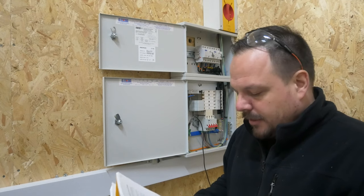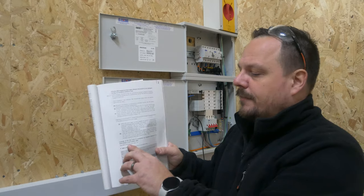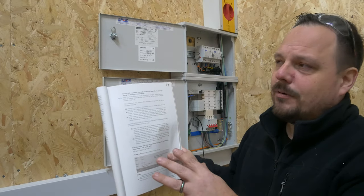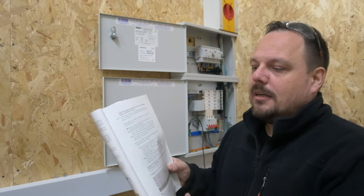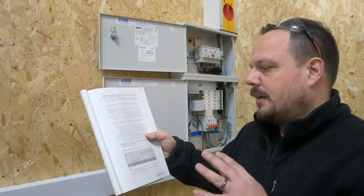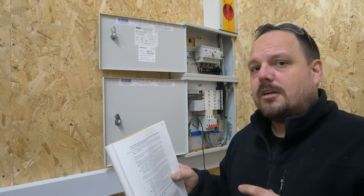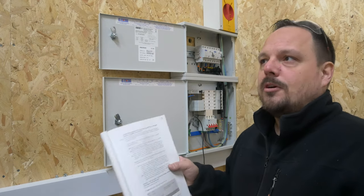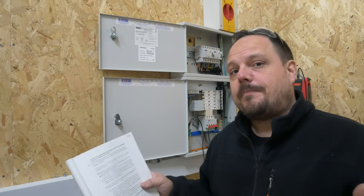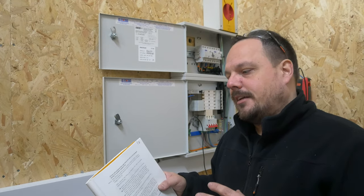When it's talking about your insulation resistance test on a three-phase circuit, this is talking about a four-core power cable, but it's the same principle. It says here that we also need to be checking this at first fixed stage, so we need to be doing an insulation resistance test when the cabling's installed. In a bigger, more complex installation that can be months apart, so it's really important that you do that to make sure there's been no issue of the cable getting snagged — because it's a lot easier to put right then than later on.